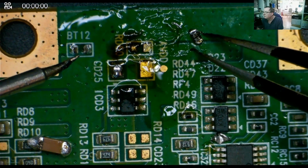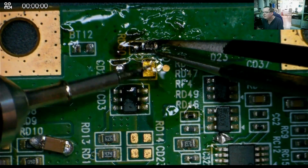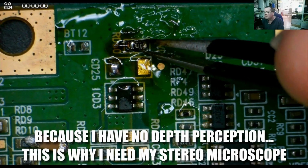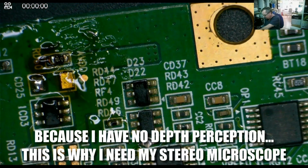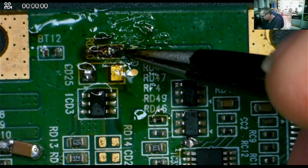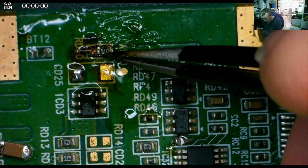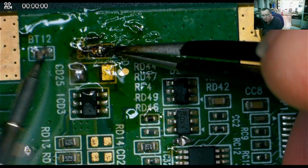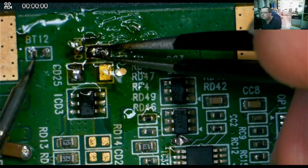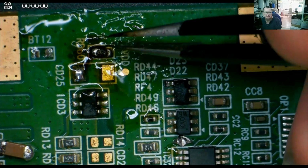We'll now come in with the component, so I'm coming in right-handed with the component, left-handed with the soldering iron. I am right-handed, so this is not my preferred hand. And I clearly don't have the component flat. Okay, I have the resistor basically in place. I have my little bit of solder on the board. So let's warm this up and let's see if we can solder it. Yep, that's got it. Second time.